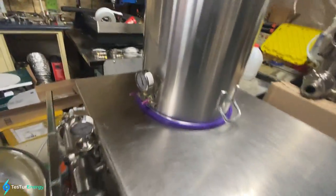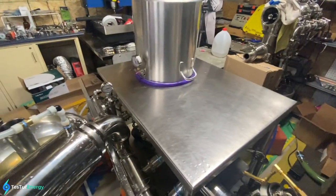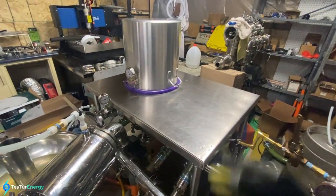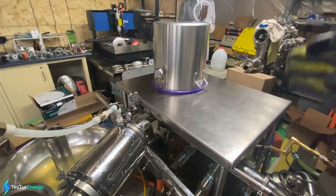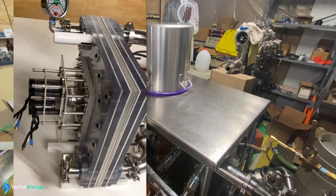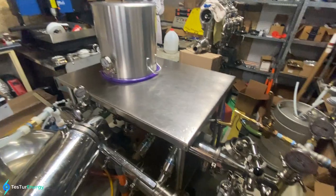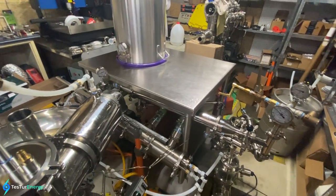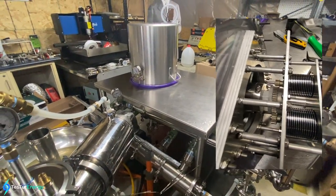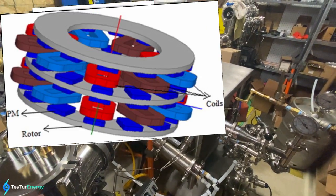I really hope you guys can hear this — that sounds awesome. It's quiet if you're not familiar with the turbine I'm talking about. I can't open it right now but I have a couple of videos — check the corner or end screens. That is sustainable power right there, especially because I have two gears and two generators, each with iron losses and armatures. If we went with a coreless axial flux direct-on-shaft generator, all those losses from the gears and generators would be available as power out.